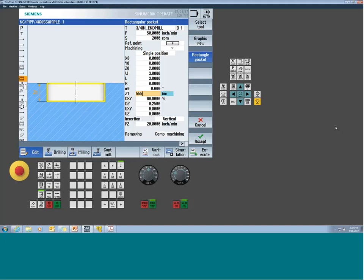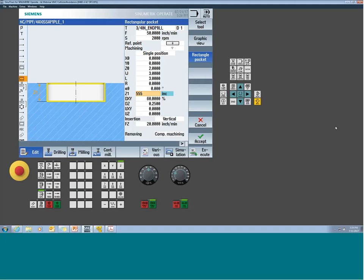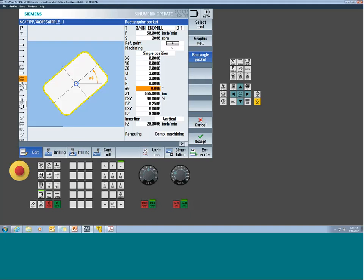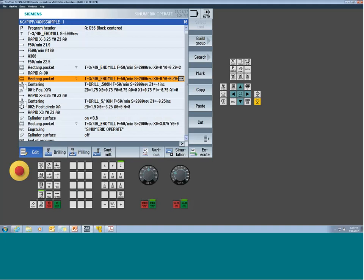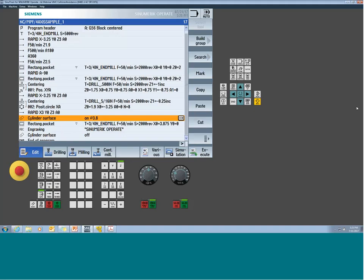How does TRACYL work on a 5-axis machine? Swing over the AB, or then TRACYL C, A-axis or B-axis. So the TRACYL function is commissioned. So part of the setup is how we want to allow it to orient about. So on my machine here, I'm going to cancel this. When I went to TRACYL, I had the option of 2 different transformation types. So if I go into the machine parameters, this is what's going to start to control the nature of TRACYL. They potentially could set it up so TRACYL could work around multiple rotaries, but it is part of the commissioning, so we would need to see. I think on the CTXs, they at least handle TRACYL about the primary rotary, and I think you can do it on the secondary rotary. But that can change from builder to builder.